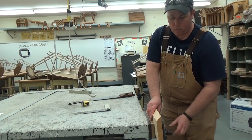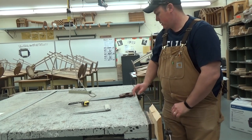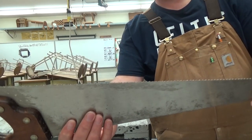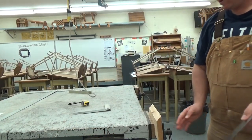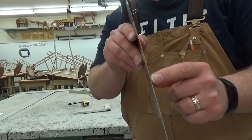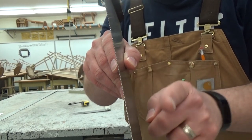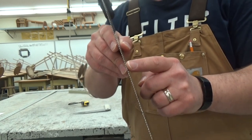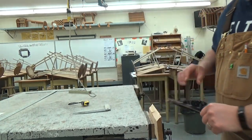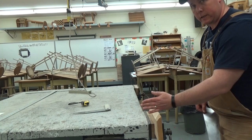In class we would be cutting off these tables with a handsaw to begin with. Here's our handsaw — this is a crosscut saw, so it's meant for crosscutting, which means cutting across the grain. You can tell that because there are so many little tiny teeth and the teeth are going one way and out, back and forth opposites. A rip saw would have bigger teeth and it would be for cutting straight — ripping with the wood grain. Instead, we're crosscutting this way.